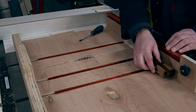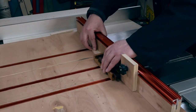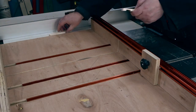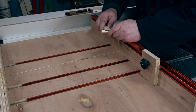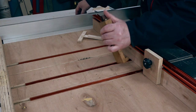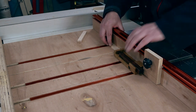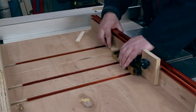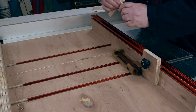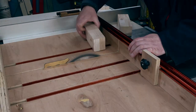We're using a couple of test pieces here for the first try, just to get it set up before we go with the big joint we've got planned. Here we are — first cut. We've got the screw a little bit far out so I'm expecting this to be a little bit on the snug side. Yeah, as expected. Very small adjustment of the screw turning in — let's try that again. Just run through one more time, and let's see how we go this time. Just looking for that perfect fit, and I think we've got it. Yep, here it is — Kerf Maker is set.